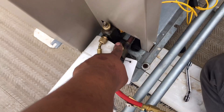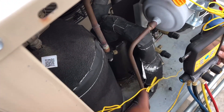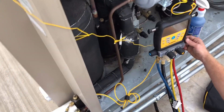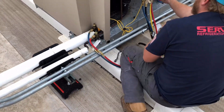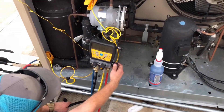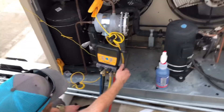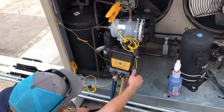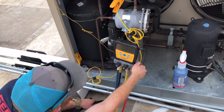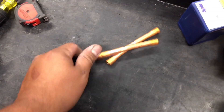This valve's not holding so we had to pump it down right here from the king valve. We're just letting out all the gas that was in here — we pumped it down already. We're ready to go inside and change — I'm gonna remove those dryers, check the TXV screens, and then we'll verify with superheat.